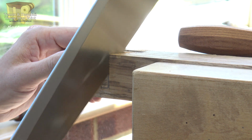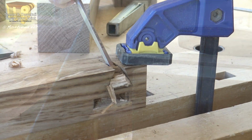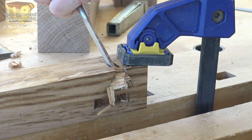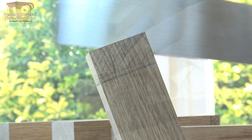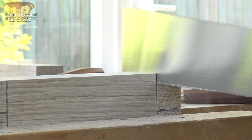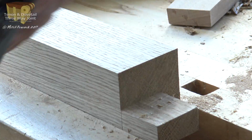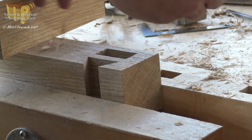Now it's possible to saw in half of each side of the dovetail socket, but after that it'll be chopping. The tenon cheeks get ripped in the vise, and then I can cross cut the shoulders. After some clean up of the dovetail and tenon shoulders and a little bit of fitting, everything will come together nice and snug.